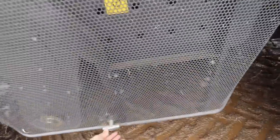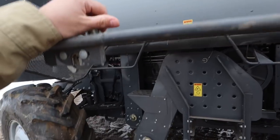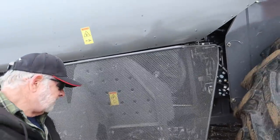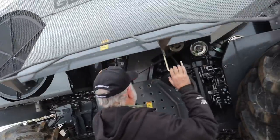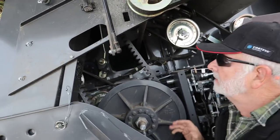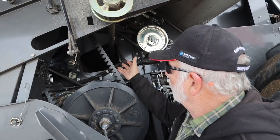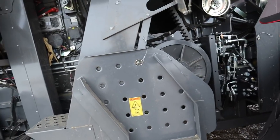One thing I think is neat about how this combine is designed: that platform folds down, you've got stairs and a step to reach up on — just nice little things. There's a step to get to all your grease points and maintenance items. Everything's pretty well at ground level. The rock trap is a little cumbersome — you've got to reach in there with that stick to get it — whereas on the Claas you're right under it, though that's also under the feeder house which is dangerous. Anything that isn't ground level, a step flops over and you can get to it all.